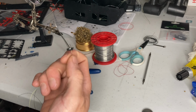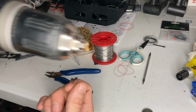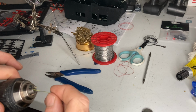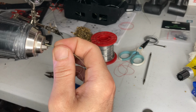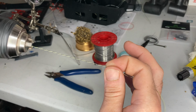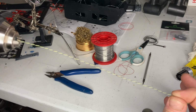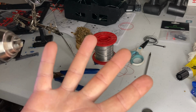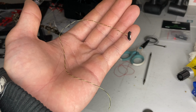Right, another thing that I do with these, so once it's been put in its nice little plastic piece, I get a drill. Put the piece in the drill so it just about holds, and nice and slowly, if you hold your 2 cables, you can start spinning this, and move your hand down, and then you've got some beautiful twisted cable. Right, so there you go, look at that. Cable's now nice and tidy, so that's good.